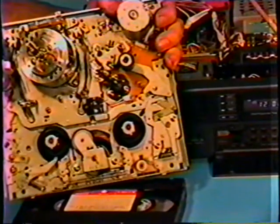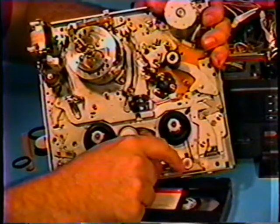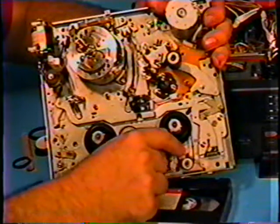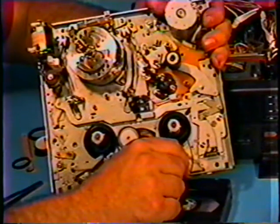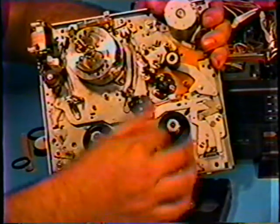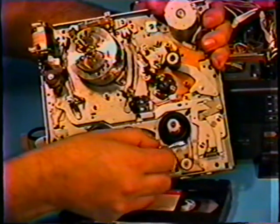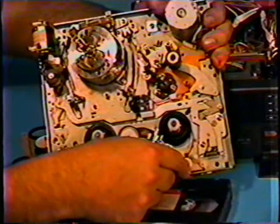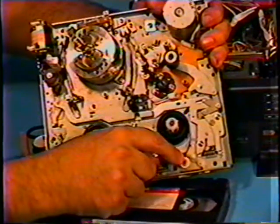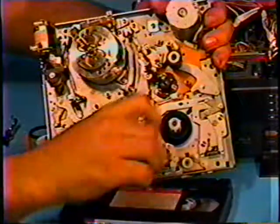And what actually has happened, I'm going to bring out my demonstration model again, is the belt that goes around this spool and around this little idler here has been removed. It's been pulled off. It could be broken. What I have seen happen in a couple of machines is people had kids, something got dropped in the machine, they took it apart and by reaching in there, they removed the toy that was in there. But what they didn't realize is they also had pulled the belt off the spool. Now it's not turning the little spool down here, which is telling the computer everything's fine. So I'm going to correct that situation. I'm going to replace it and get things rolling along here again.